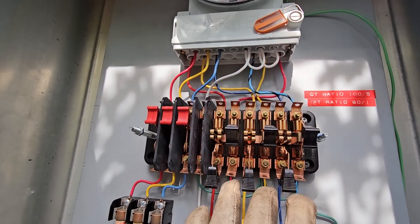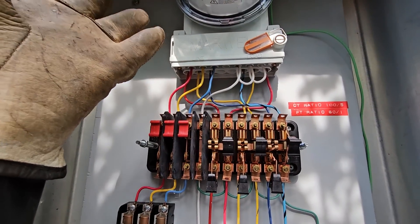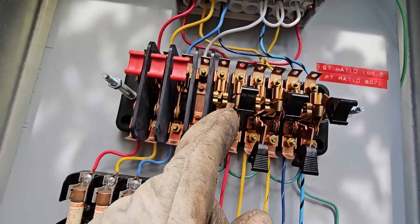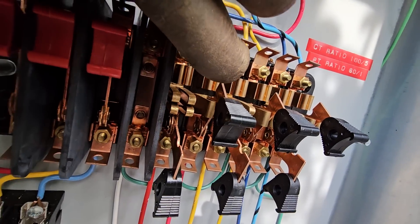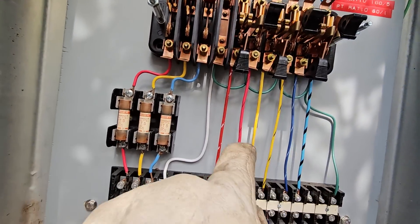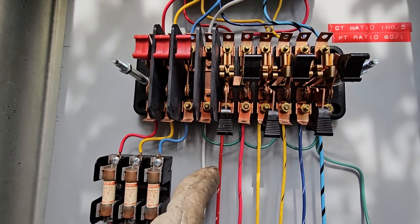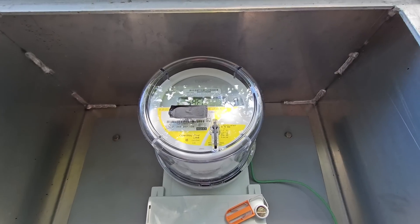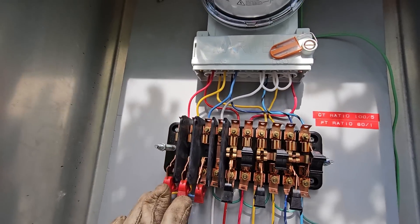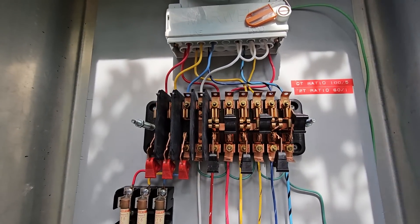The customer still has power — with a transformer-rated meter these tiny wires don't carry the customer's feed, so there's no interruption; they're essentially getting free power right now. With the switches down, this lug here is shorting against the center lug, which is connected to the bottom, causing a short between the positive and negative sides of the CT. The meter is still alive, but we also have a disconnect for the potential side. Now with everything isolated, we can pull the meter.